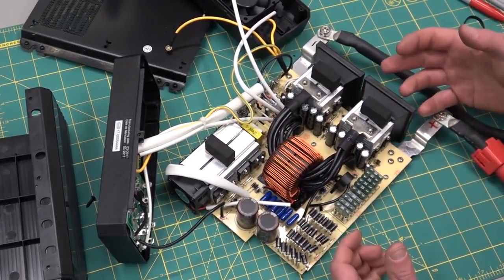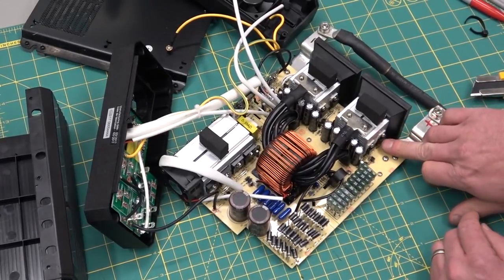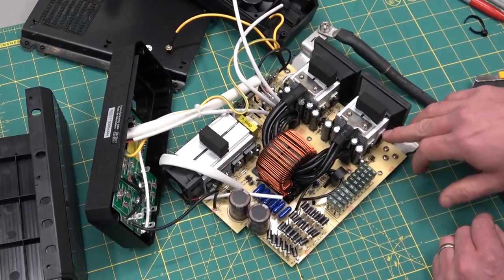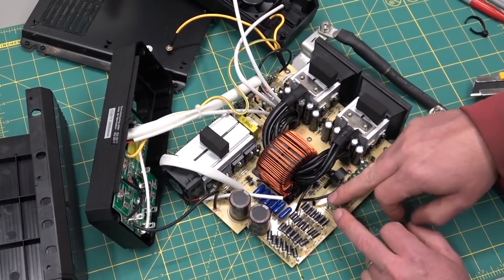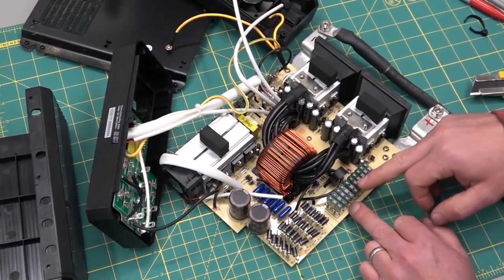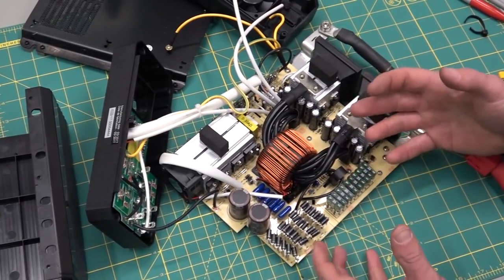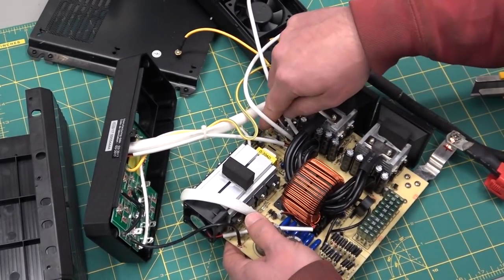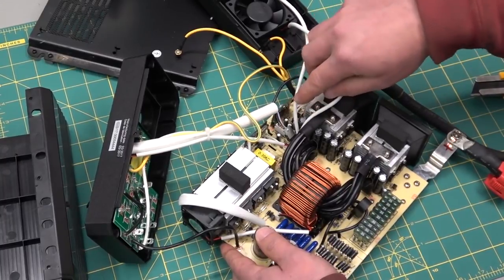There's nothing for it but to replace this thing. If you can get warranty on it, great. If you can't, you can go in here — these are all through-hole components, so it'd be fairly straightforward to get the part number off and replace them. These fail open, so they fry and then go open circuit, nothing goes through. The protection fuses — 350 amps worth — very likely these fuses will not protect these MOSFETs. So first things first, you check for scorch marks, then you check the fuses. If it's something other than that, you're probably going to be hooped. One thing I didn't mention — these daughter boards, soldered in, wave-soldered in at 90 degrees. You can see this is the brain box because it's got a clock — it's got a quartz crystal oscillator right beside it.